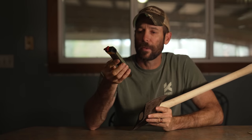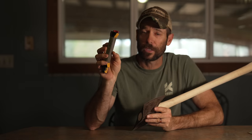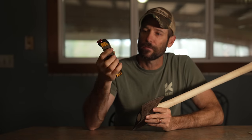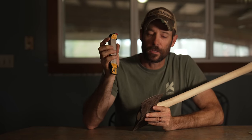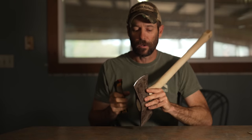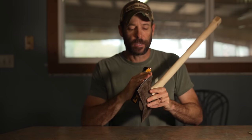I'm going to be using this WorkSharp Field Sharpener — I carry this in my backpack all the time. On this thing I've got a relatively coarse grit, looks like maybe a 320 or so, a fine grit over here maybe 600 or 800 grit, a ceramic, and then a little piece of leather for stropping. I'm going to start with this coarser side right here, raise another burr on this thing — a smaller burr this time — and then come to the other side, take that off, and move on to the finer honing stone.